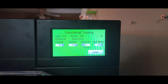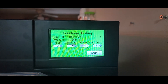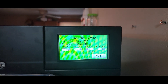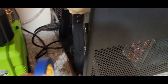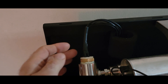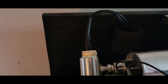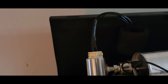We're fixing the epoxy on the connector. We've been running for an hour and we're down to 366 millitorr, which is a good vacuum and still dropping. I'm going to take some tape and wrap it around this part right here on these wires, then mix up some Loctite clear epoxy and put some of that on there.